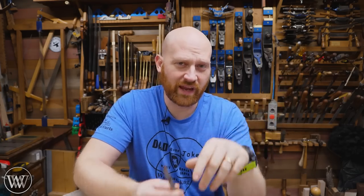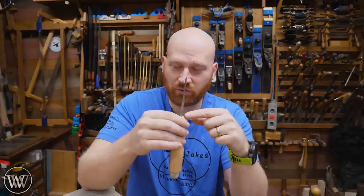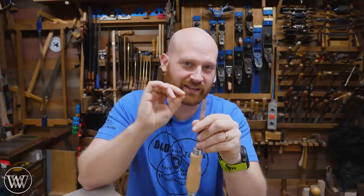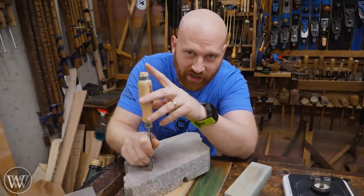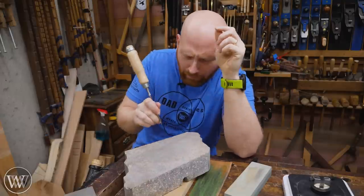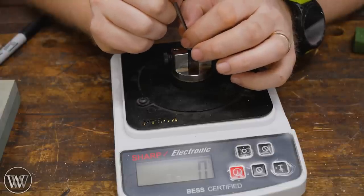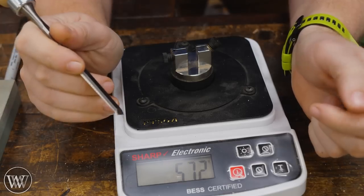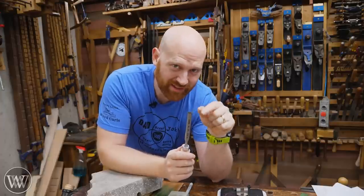500 is around the point where the average person thinks a kitchen knife is sharp, and from there they go on up. So if I can get this edge under 200, it will be phenomenal for 90% of the work. If I can get it under 150, it can be incredibly keen. This one is currently around 150, so the first thing we need to do is dull it — and this is going to drive a lot of people crazy. After dulling it, the reading is 572. He's really, really dull — I don't even let my scrub plane get that dull.